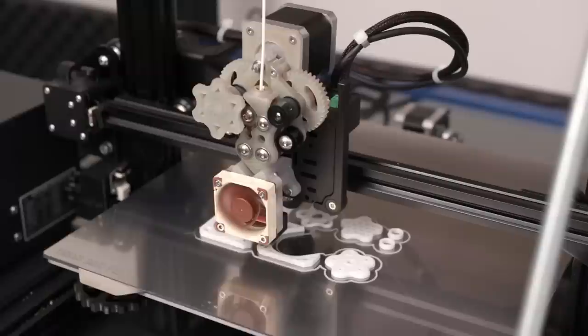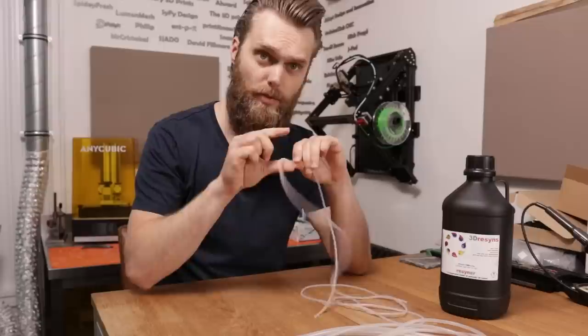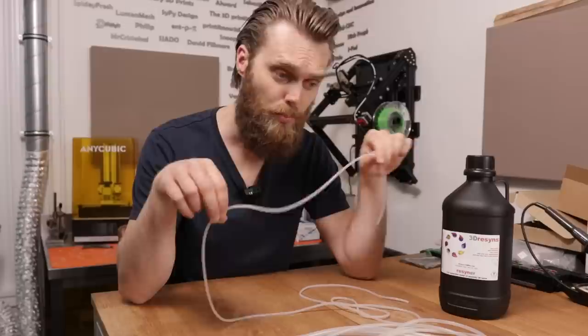The big disadvantage of a peristaltic pump is that it has a pulsating movement with each roller pushing the fluid through the tube. I think I have an idea how to compensate for that, but first I want to see how bad it actually is before I try to solve something that isn't actually an issue.